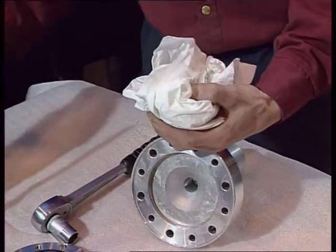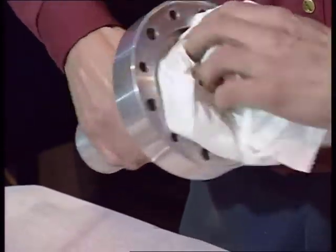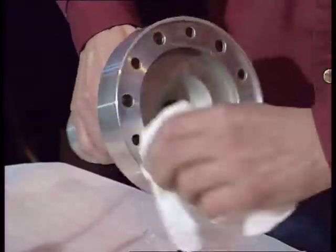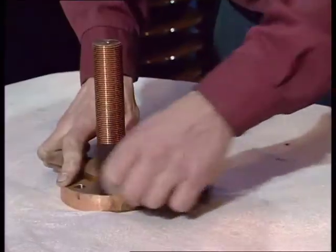In order to obtain the correct pressure and low contact resistance, dismount the terminal stud and carefully clean the contact and gasket surfaces. The outer terminals may be oxidized — if this is the case, rub them with Scotch-Brite.